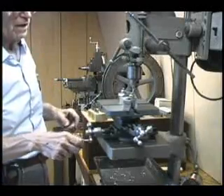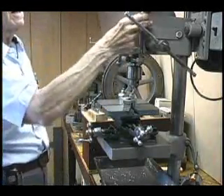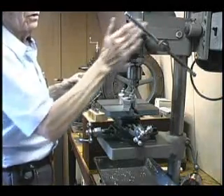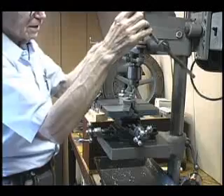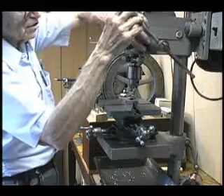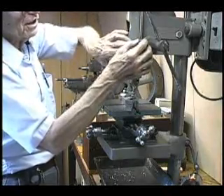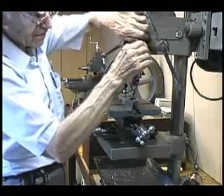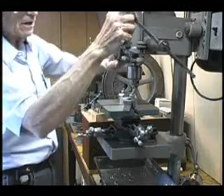As I back off, I know I need to bring it down just a few thousandths of an inch more. I'll be within cutting distance, and I'm going to use my stop nuts as a means of controlling where I place the tool for the depth of the cut. When I run this back under, I'm already touching, so I run this down. I know now that I'm on my zero point. This is a one-sixteenth inch pitch, so if I go up about a quarter of a turn, I know I've taken about eight thousandths of an inch. I lock it in position, back off, bring the spindle down, and lock the quill.